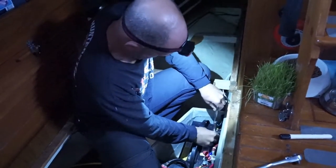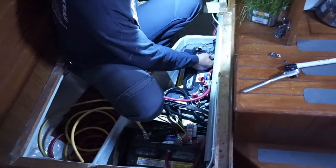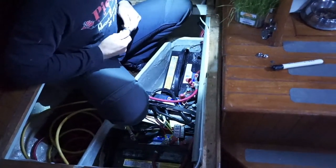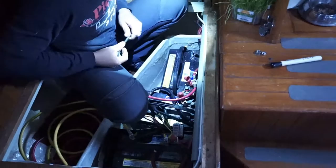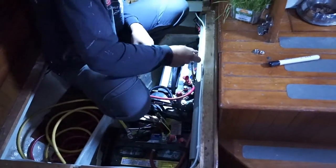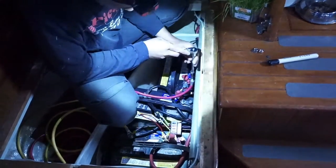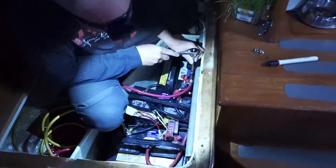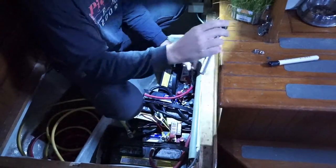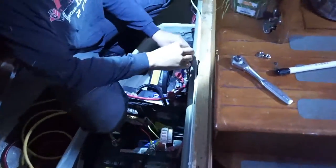The AC is all on the new panel. These are AC Delco Voyager Group 27s, 95 amp hours. They've got these little built-in hydrometers that tell you the state of charge. It looks like only two out of the three batteries are reading green according to the little floaty ball in the clear window. This battery back here is not.